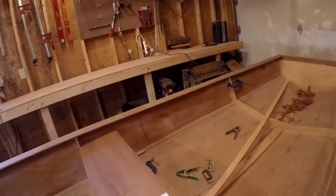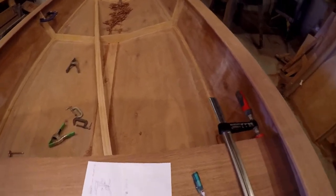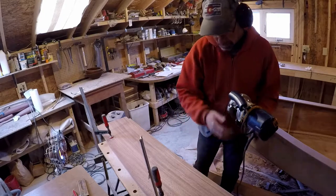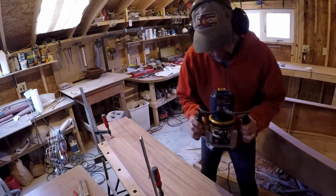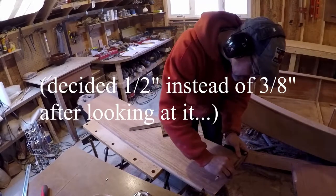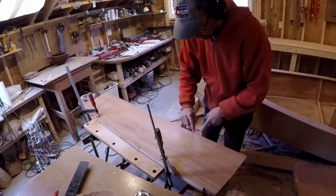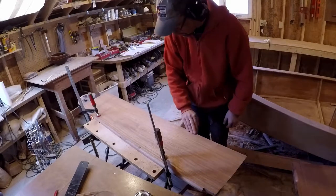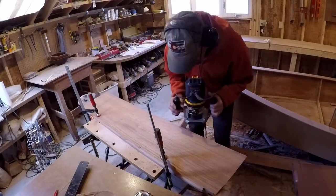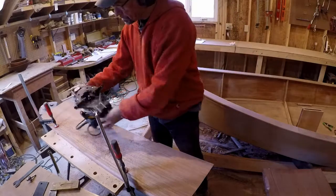Thinking we just come out 12 inches and have it follow the contour on the side of the boat. Back with a smaller round-over bit for the bottom edge — you want a nice, really good feeling curve here. The plywood to lap on here is 3/8ths, so we'll just take the same bevel. The plywood seats will sit in here, so we've got to keep a little bit away for how that joint's going to be. I think we'd go right on across this. By half inch, taking it out, I'm going to use the fence.